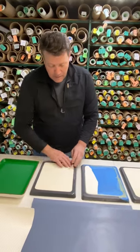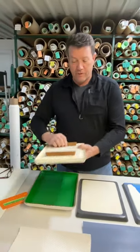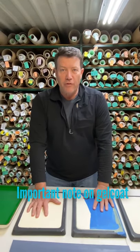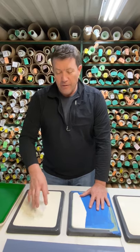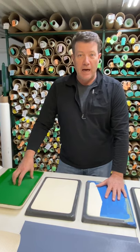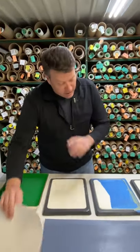Once we've completed that, we have our clean part. Then we go to wax and then gel coat, make our mold off of it, and get our first part out of the mold. It's important to understand that people who continue to use our rubber products with vinyl ester tooling gel coat don't have great results. The rubber product we started 25 years ago sometimes will stick inside the mold you're making — you'll need a power washer to get it out, and it may tear when pulling the mold off the plug. But normally it would just come right out. So that's the rubber.